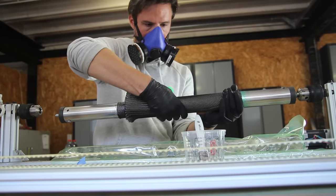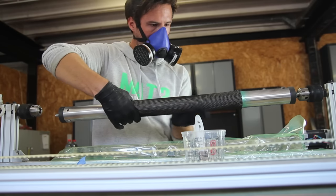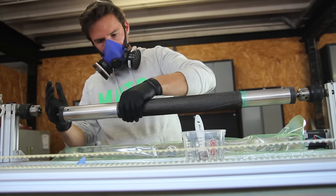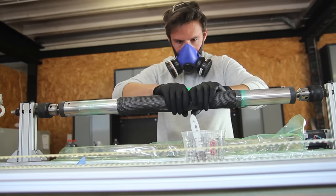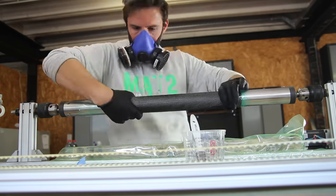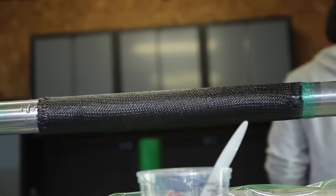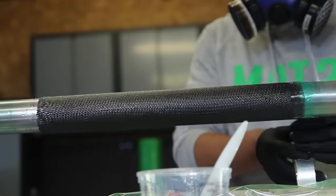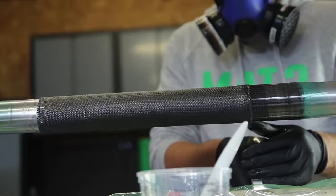This process is about using a pre-made braided sleeve on a mandrel. You can add a lot of width to the tube by compressing it together, then pull it tightly over the first layer. The main goal — especially for beginners — is not to add too much resin. You don't want that glossy epoxy shine; the compression from the shrink wrap gives you the high gloss finish.